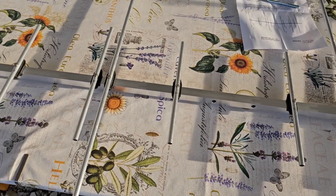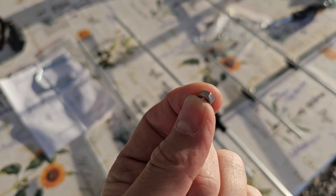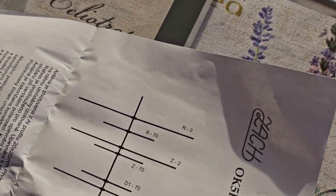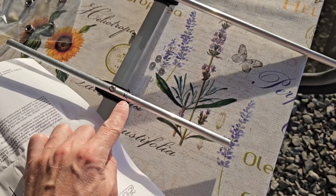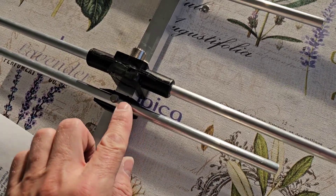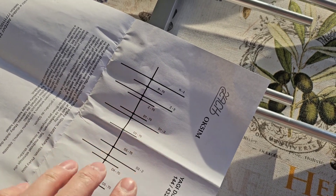All the elements are attached to the boom. Before I secure them, let me check everything. This is the reflector for 2 meters, reflector for 70 centimeters — that is reflector for 2 meters, that is reflector for 70 centimeters. Now we have the driven element for 70cm and the driven element for 2 meters, plus director 1 for 70cm and director 1 for 2 meters.